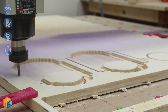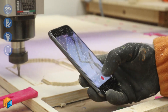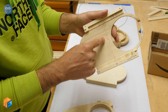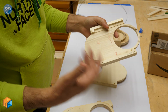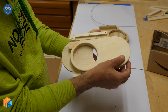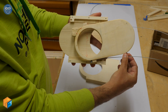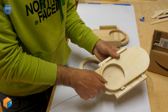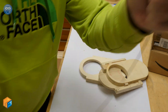I switched to the second design and used 4-millimeter poplar plywood. Even here there were some measurements to correct, and I always mark the errors directly on the prototype in order to report the issue and then fix them on Fusion 360. But then I discovered a design issue: when I pull the Bowden to close or open the gate, the shutter does not move straight — it turns and goes outside its rail. So I moved to the final version where I pull the shutter from the center; this way the movement is horizontal and no issue arises.